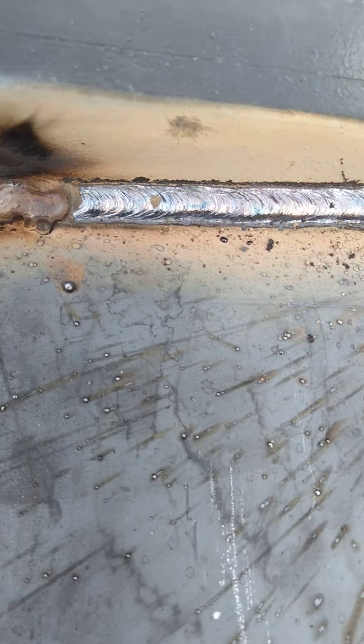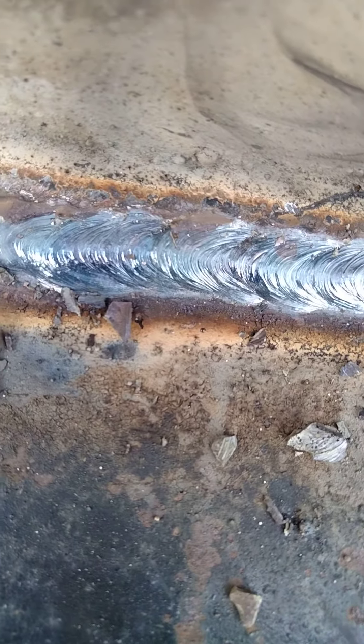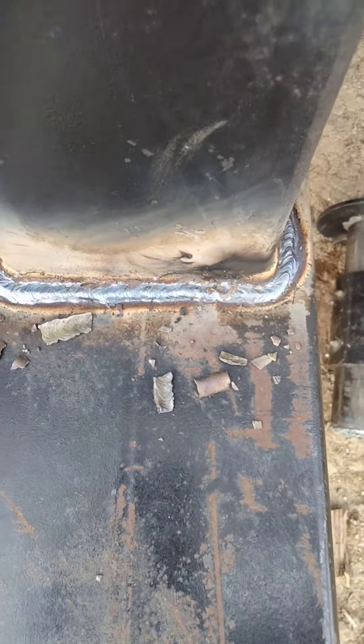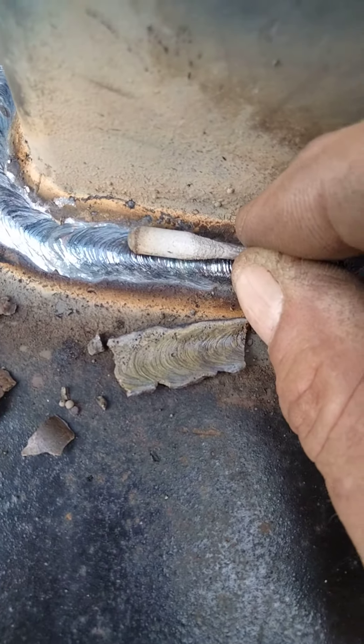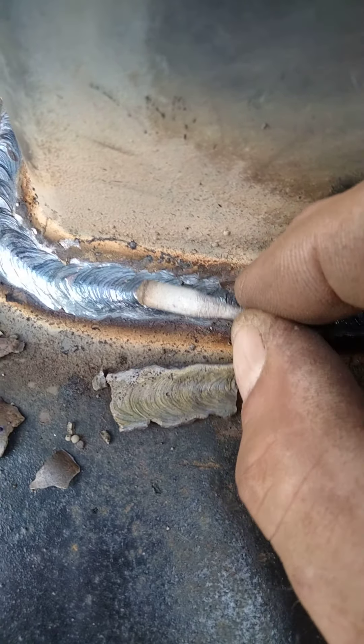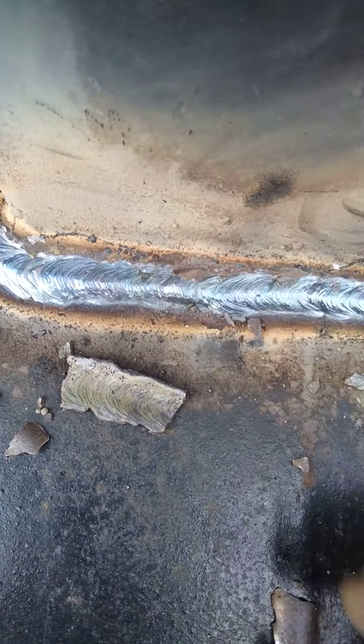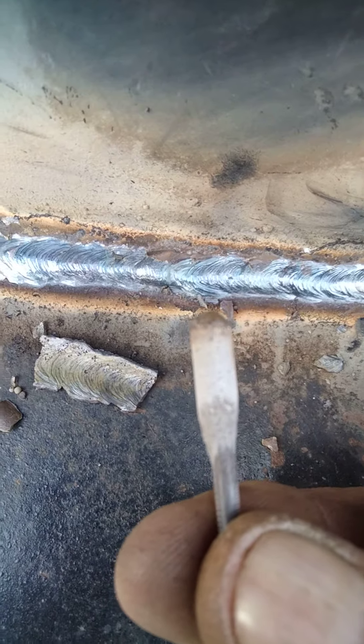When you start getting wider — like over here, there were some cracks around this here. You see a little blue in it, but not a whole lot. That's because I weaved the pass wider and went over half of their stuff and over the crack itself too. Rule of thumb is you don't make a bead wider than one and a half times the thickness of your rod. This is eighth inch, so really for this rod, that size of bead should have been 5/32. That's just rule of thumb — you don't make a bead wider than one and a half times the thickness of the stick you're using.